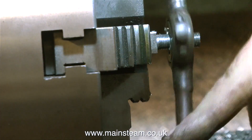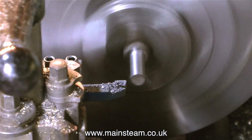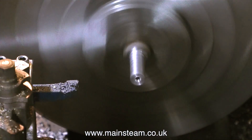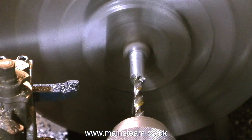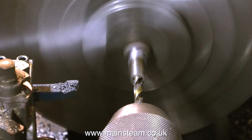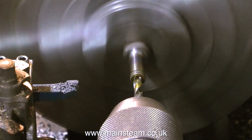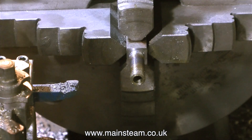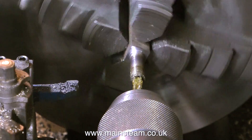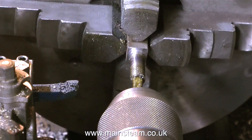At the beginning of this sequence I did use some cutting lubricant - it's an old tin of cutting lubricant kept behind the lathe. The next job is to make the internal thread. First I face off the end, then use a centre drill followed by a 7/32nds of an inch twist drill, and I'm going to thread this 1/4 inch by 32 threads per inch. During the drilling the piece of steel was getting very hot, so I used some lubricant, and once again I'm using threading compound on the tap.